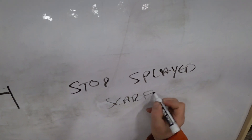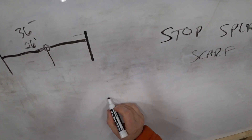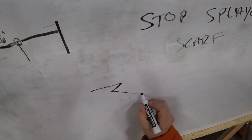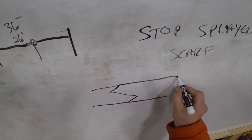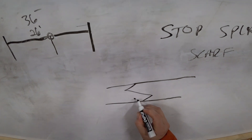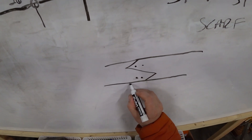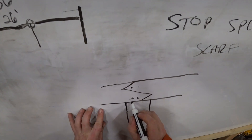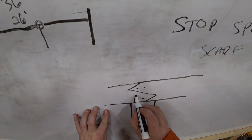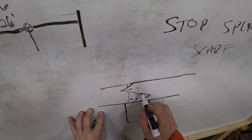It's probably one of the most common scarves you'll see. The goal of a scarf joint is to create a joint that is extremely strong in many directions. So the joint looks something like this and maybe there's pegs here, here, here, and here. And maybe we have a post that is coming up through here and there's a tenon that penetrates these two scarf joints.